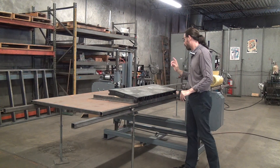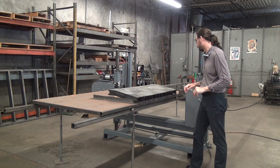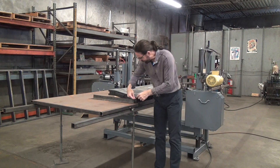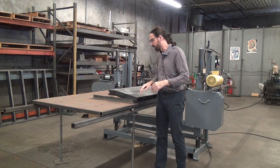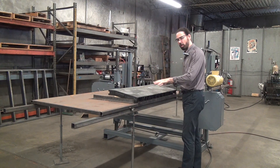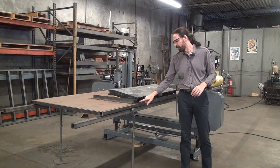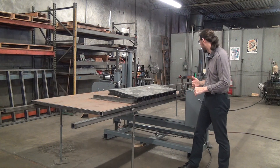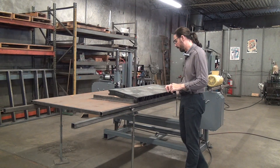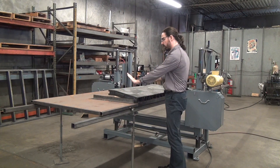This machine as standard comes with a fixed table where you slide the work piece across to make the cut. For this test cut we've put up a temporary rolling table — it's light duty but it'll work fine. The real hard part is getting a nice angle cut across here. Doing a shallow angle cut on a work piece like this is tricky in terms of fixturing and keeping the blade from dipping or rising. We have a lip on the edge of the table to keep the work piece from being pulled sideways, a trailing edge lip, and a wooden ramp fixture underneath to set the angle.